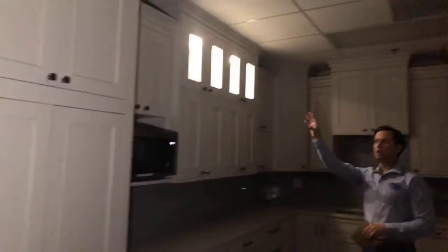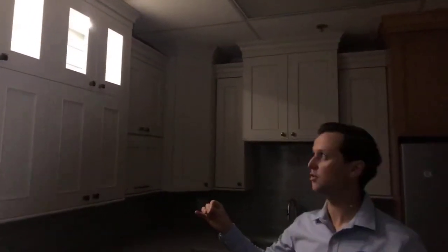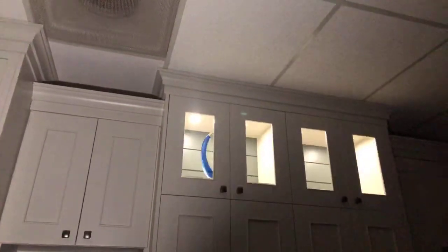Now these are pucks — puck lights. We've been showing kind of a tape before, which we'll get into more. You also have these little round pucks that you can place. Puck lights can go anywhere; some people prefer to use them under the cabinets, but mainly what we're seeing nowadays is people are using them behind the glass. The best part about the Task system is all the temperatures of our lighting go together — if you have a 3,000 temperature tape light and a 3,000 temperature puck light, it's the same. Most manufacturers don't do that. And they can all be operated from the same remote and the same power supply.